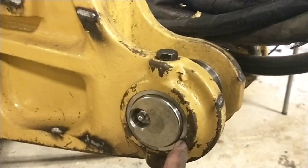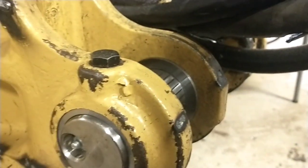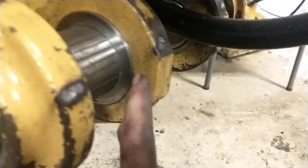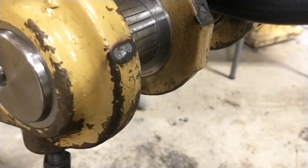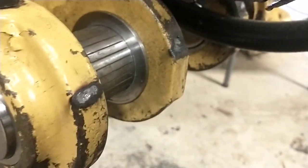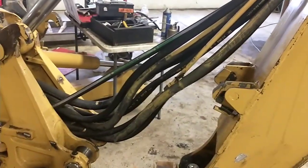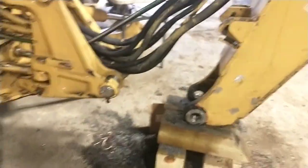We've got good solutions here. These — I didn't put quite as heavy a press on them, mostly because I was concerned about putting too much tension on these ears; they looked a little thin to me. I put about a thou-and-a-half per inch of press on, and I was able to drive those in with a block and a three-pound maul. The one here is captured by having a bolt through it, and then this one I put a shoulder on it. It worked out really well because CAT left all kinds of clearance between those ears, so there was plenty of room to leave an eighth-inch shoulder on my bushing — it can't walk in because it'll run into the boom, and it can't walk out because of my shoulder. That ear is only seven-eighths of an inch wide, and thin bushings have a nasty habit of trying to walk their way back out.